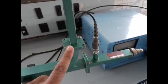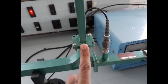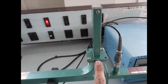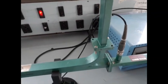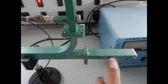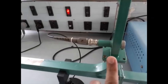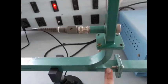If we want to measure the power at port 3, we have to disconnect this connector, disconnect this detector, and connect it here. We have to disconnect this matched termination and reconnect it at port 2. Then we can measure the power at port 3. Now, matched termination is connected at port 2, so we can measure the power at port 3. Port 2 is already measured and port 3 is measured.